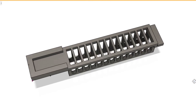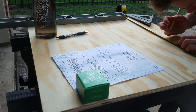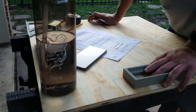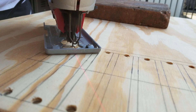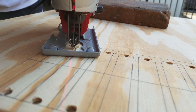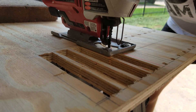Here's the model of the new battery enclosure that I made in Fusion 360. I plan on making this out of half-inch thick plywood, and it features 13 slots for four batteries in parallel. Each slot is spread out to facilitate better airflow. I planned on using nickel strip to spot weld each parallel group together, and then use gauge wire to hook every parallel group up to one another. This way it'd be easier to modify each parallel group individually, and swapping out a parallel group would be as easy as unscrewing a couple of screws and just removing it.